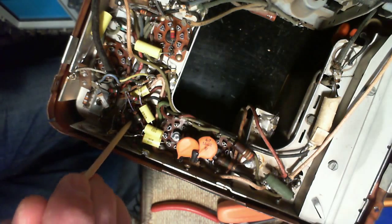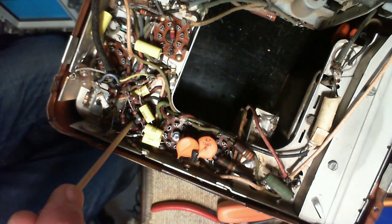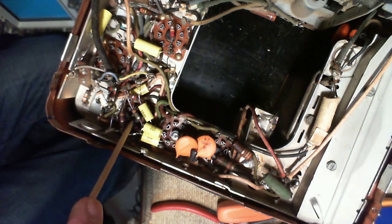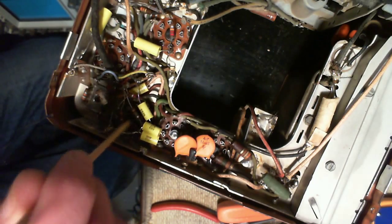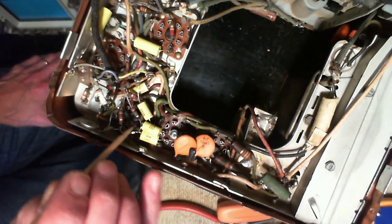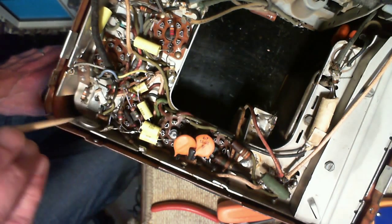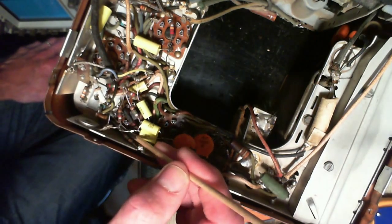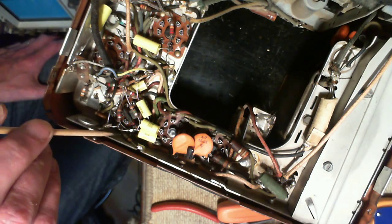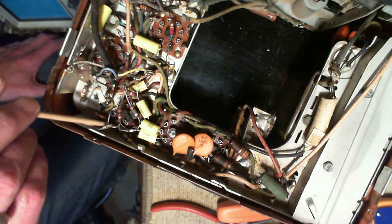So I'm pretty sure this is the right tube. Let me double check here. Not that I ever make mistakes, but you never know. SR7. Right on the back wall, yeah, right there. That's the tube, so pin number 4. So let's see, that's 1, 2, 3, 4. So 4 has a large resistor to ground. So right here. So all I gotta do is get on that.